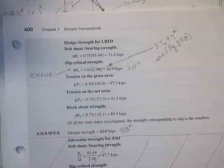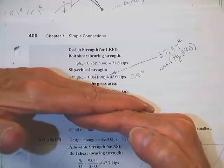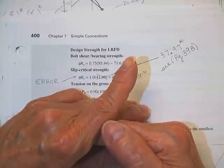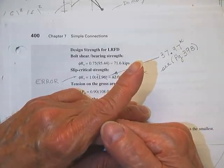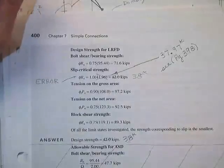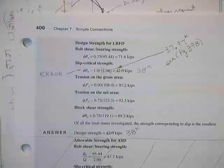But in a bridge, when the truck goes in this span and the bolts go, and then he goes to the other side of the span and the bolts go. Did you see that? The little bolt fell out. Well, the little bolt fatigued and it broke. And, you know, that's not that bad. There's one less bolt out of 40 in there. Probably live with that. By the time we inspect it, we notice 3 bolts are missing. And so we got to have a real slip critical connection and put no more load on it than that for some cases.